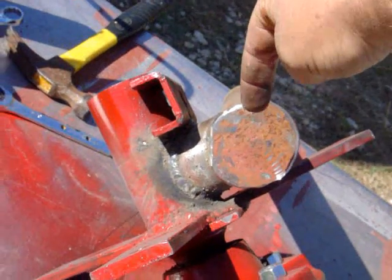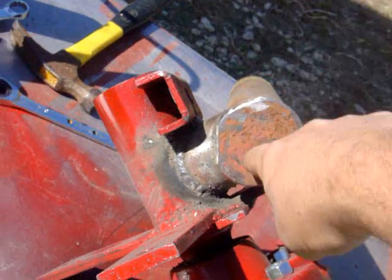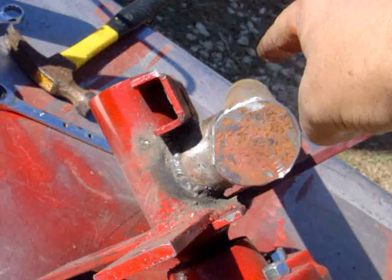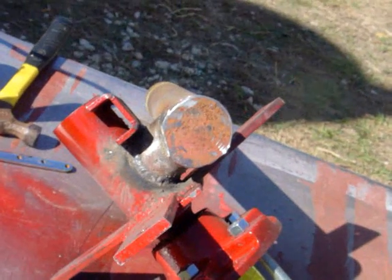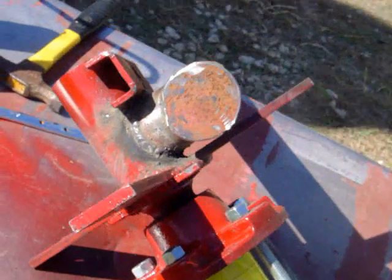Not straight back, but off at about this angle. There'll be another pipe that comes up 22 degrees from this center. It'll come up 22 degrees and that's what my tail is going to sit on. That pipe should be anywhere from about 10 inches to a foot and a half, and the tail will go on to that. The length and the weight of the tail will tell it when to furl.